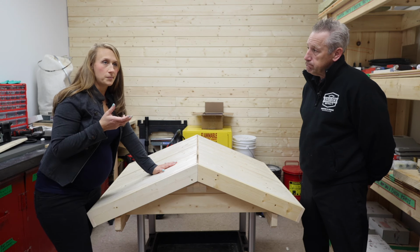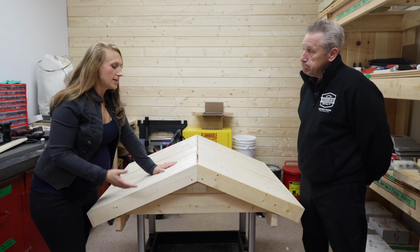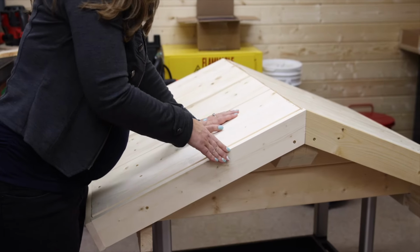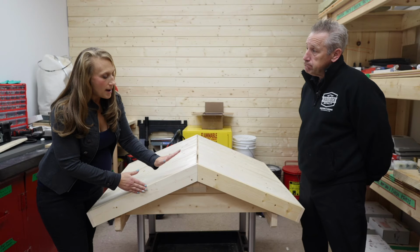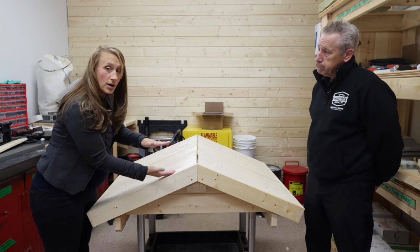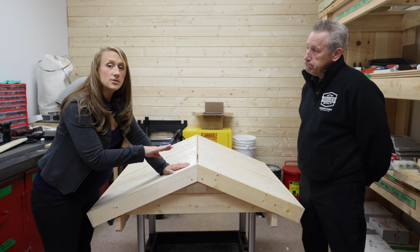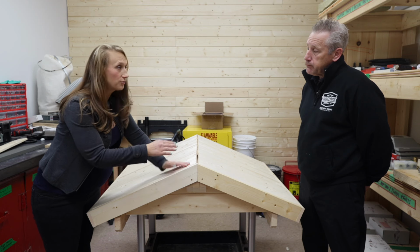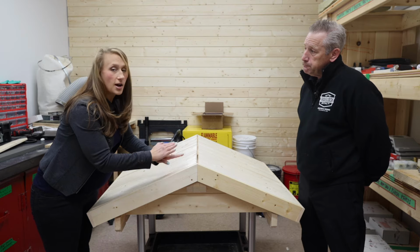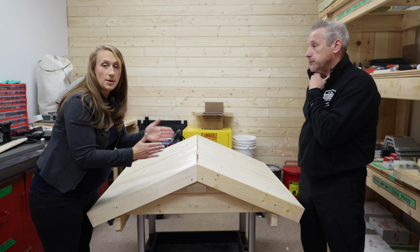There's also, I think I call it in the roofing ordering guide, an optional fascia piece, so that you can see some of this fascia, or you can make it so it's fully covered. And with your strapping, the one thing you want to keep in mind is that depending on how much you build out your strapping, if it's 1 layer or 2, these are the pieces that are going to cover that gap. From wherever that strapping ends down onto your fascia, these are the pieces that cover that. So we want to make sure we have the right depth of piece, or with the optional fascia, that it comes up high enough to cover it.